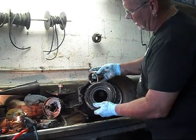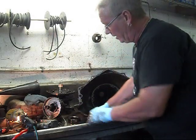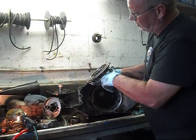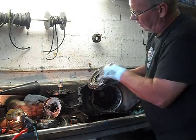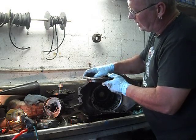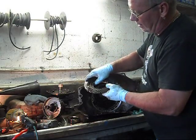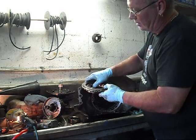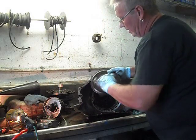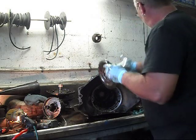I'm going to take out this center piece and check it for wear — looks good. Here is a one-way clutch. What it is, it's a roller with a spring. Inside, where the roller and spring fit, it's tapered — so it freewheels because it goes in further than the piece riding on it allows. And when it pushes out, it comes out more, so it allows it to lock up. We put this back in here — like that — and we're good.